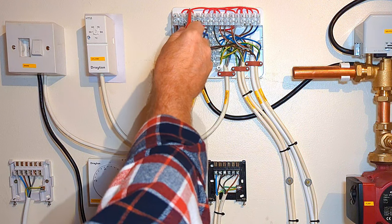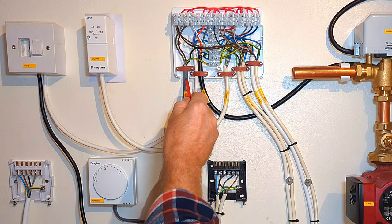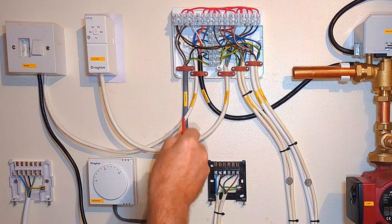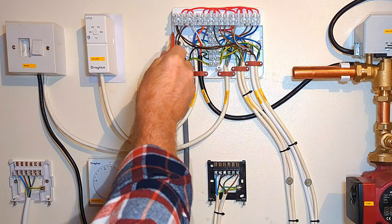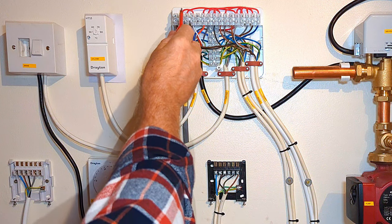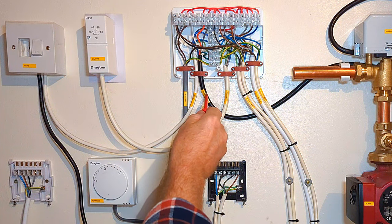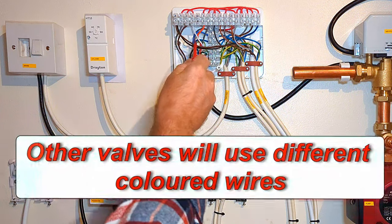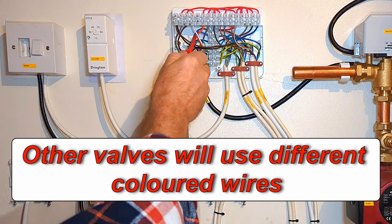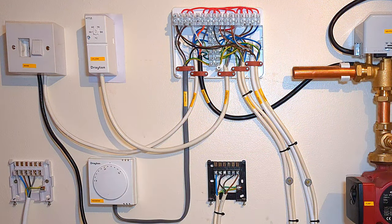Following the room thermostat wire - it goes into the room thermostat, through it, and then comes back again into the wiring center. There's a link on the top there which goes across and connects down onto the white wire on our Drayton mid-position valve - if you have a Honeywell valve you would also use the white wire. That then powers the valve, moving it into the central heating position, and when the valve reaches its central heating position it turns the boiler on.